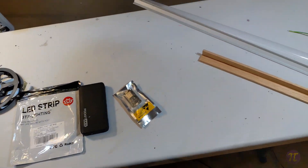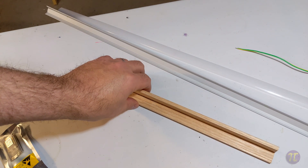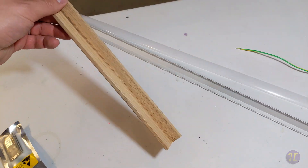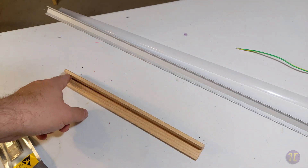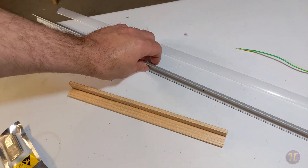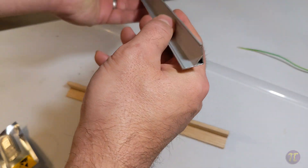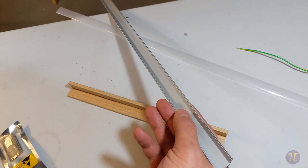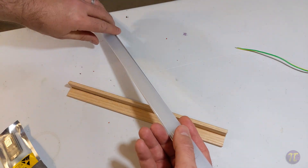The next part that took me out of my comfort zone was how to build the lamp structure. I purchased two 10-foot sections of corner oak molding, which proved to be a nice mount for the lights. Initially I was just going to mount the lights with the power injection wire running through the back, but then we decided to use aluminum channeling designed for LEDs — a 45-degree angle channel where the lights sit in the middle and a diffuser fits over the top.